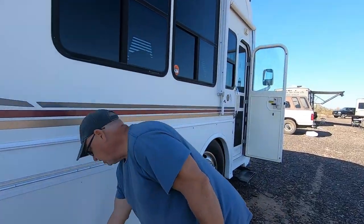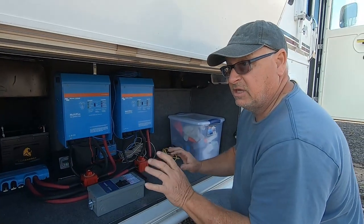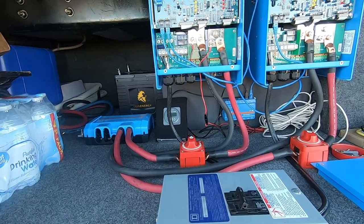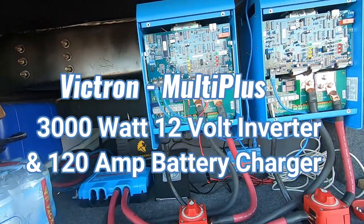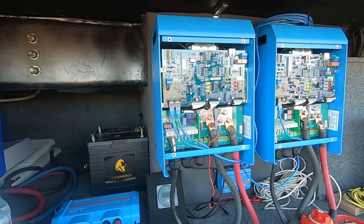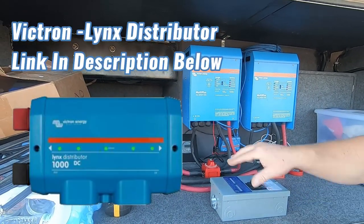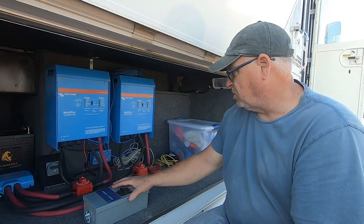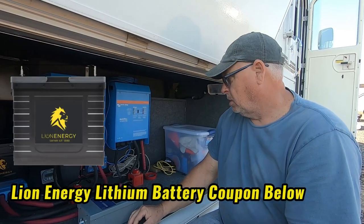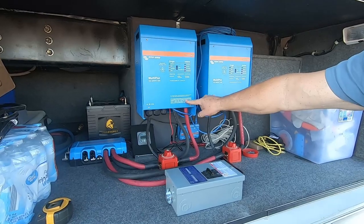Okay, so let me show you here what I got going so far. Because this is a 50 amp coach and it has two legs to that 50 amp service, I'm installing two 3000 watt MultiPlus charger inverters, so one for each leg of the 50 amp service. I've also mounted my Lynx distributor. That's where all your fuses and everything go, and then you branch off of that. So far I've wired everything to the Lynx distributor. I still have to go from there to my batteries. And then I've also run my inputs for my 110 service